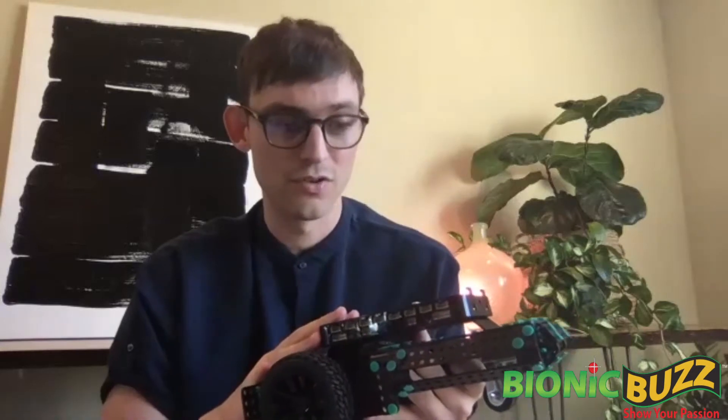The special thing about this plate is it's got an IMU with a gyroscope, a magnetometer, and an accelerometer, giving you nine degrees of freedom of control. Combined with the camera and the Hall effect sensors in the motors, this robot can be a really smart robot — it knows where it is. It's not just a dumb robot going forward, left, right; it actually knows where it's at.